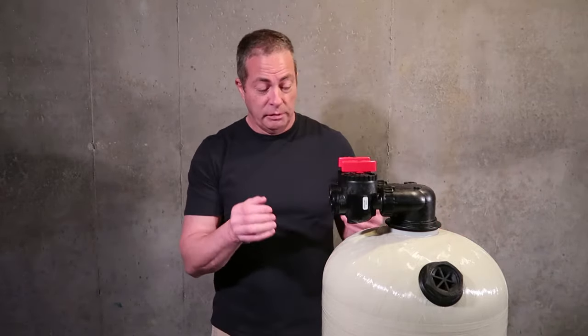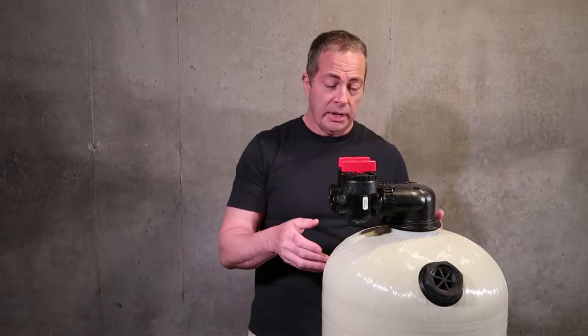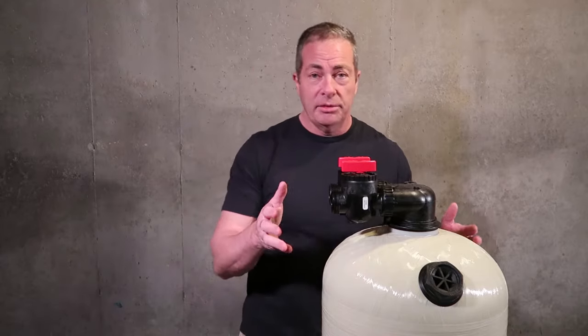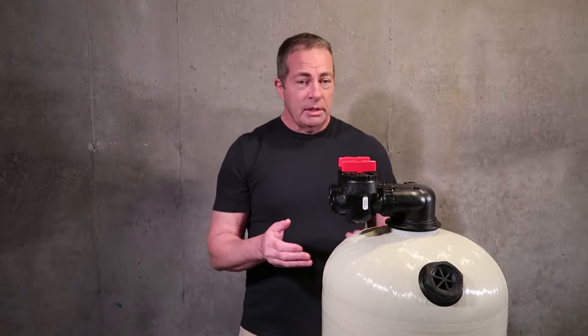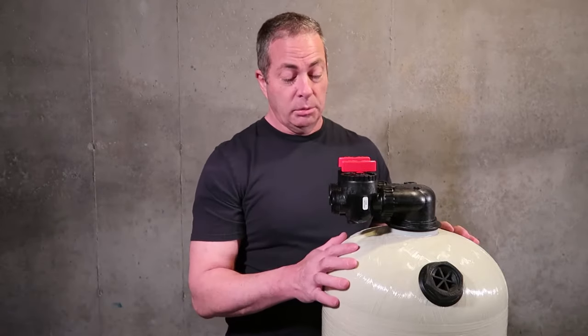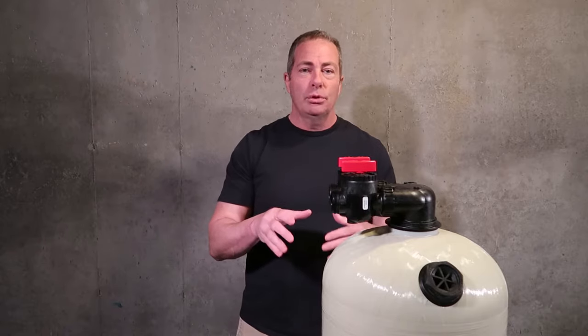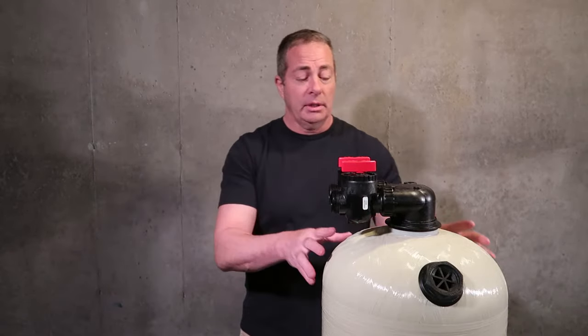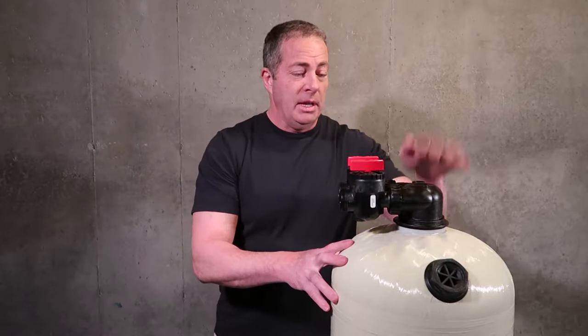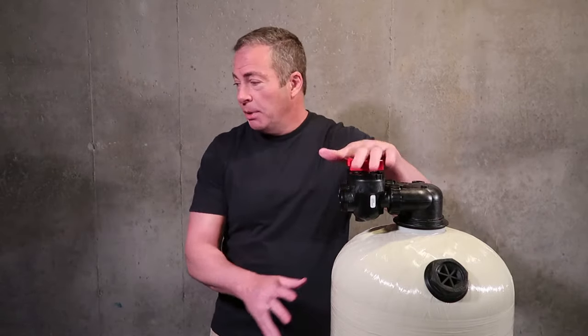If you're using a mixture of calcite and the flow mag, which is Corosex, usually in this size unit we'll use 2 pounds per 50 pound bag of calcite, and that could increase it even further. It could take it up to 8 to 10 grains of hardness per gallon of water. So at 7, most appliance manufacturers recommend that you do install a water softener to protect the appliances from scale buildup. So now we have the head, we have our bypass.